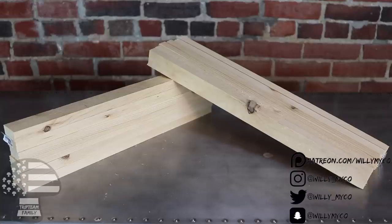If you guys want to go with a thicker or wider piece, that's perfectly fine, but you'll have to figure out your own measurements. Using the same wood I'm using, you're going to need six 19-inch pieces and six 20-inch pieces. In this video I'm just making three tiers, but you can make 10, 20 — it's completely up to you. I've stacked up to 20 tiers with one fan, and that will dehydrate pounds. The best part about this system is you can add more tiers depending on your needs.